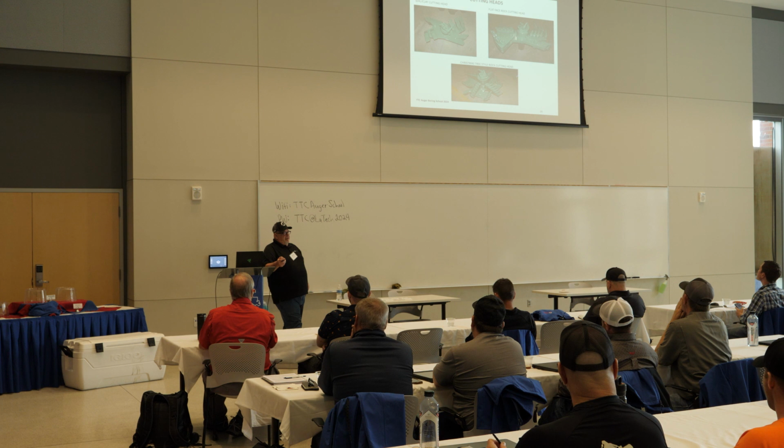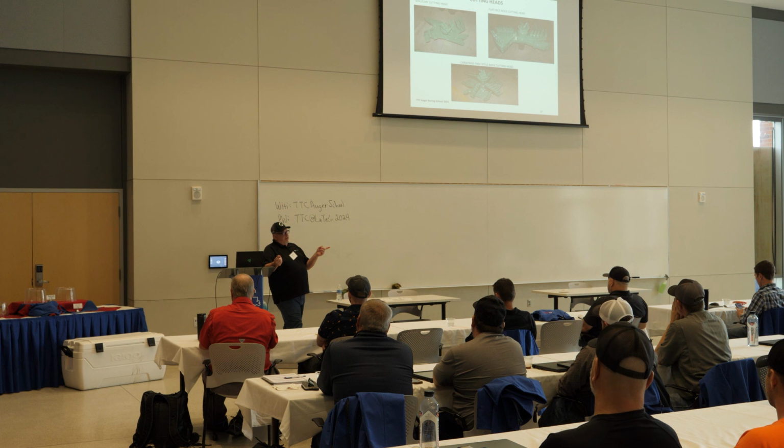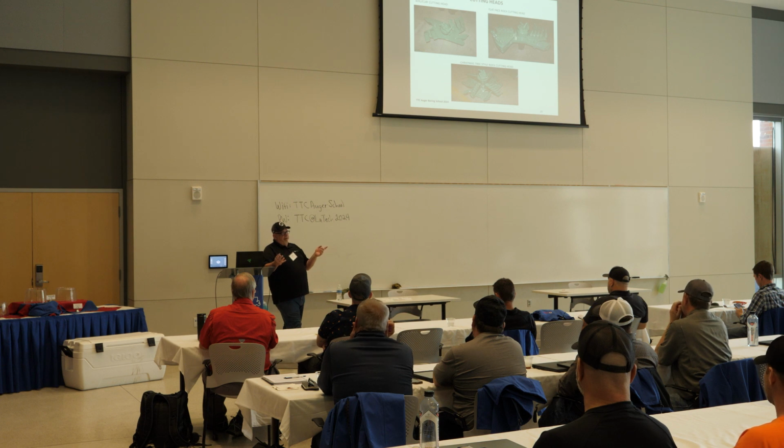They create friction because they're pulverizing the rock. So they will build up friction, they will get hot. And if you're not putting water through an airway auger or water auger to get the water right to the head, you may put water lines around the outside, put multiples, because you're going to lose one. You're going to crush it or whatever and stop the water. So I put 2 or 3 of them on there, 3/8 or 1/2 inch.